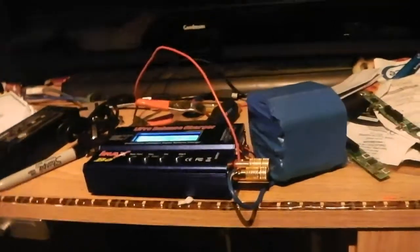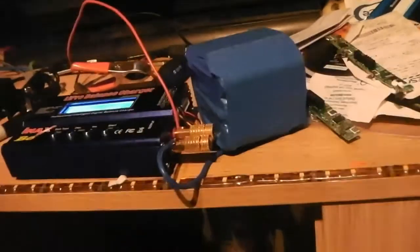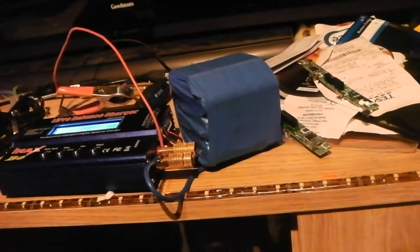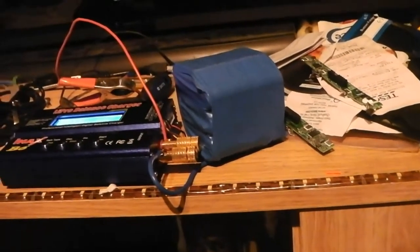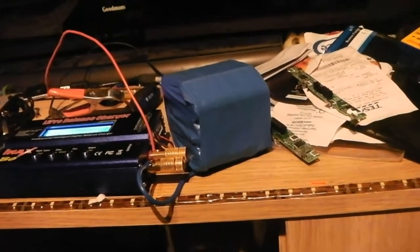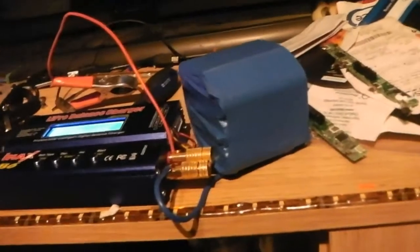The results from two dud laptop batteries found in a skip is a 16.8 volt lithium ion battery with a capacity of 7.2 amp hours. It cost me just my time, a balance lead scrounged from an old remote control car, a few beads of solder, some leftover bus wire from making solar panels, and well - after the soldering iron fiasco - two brand new soldering irons, but I needed them anyway.